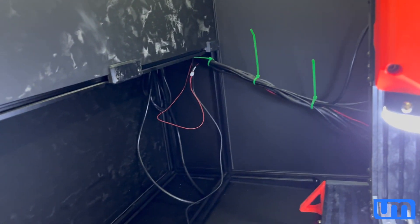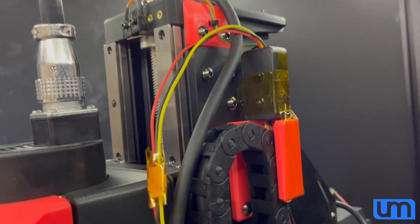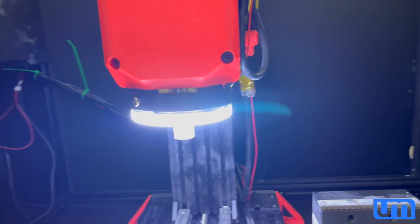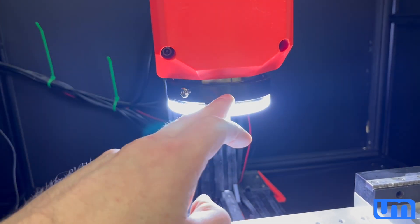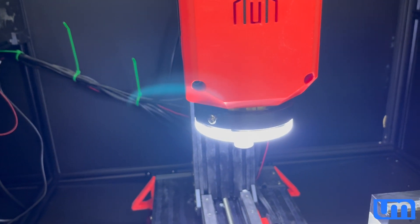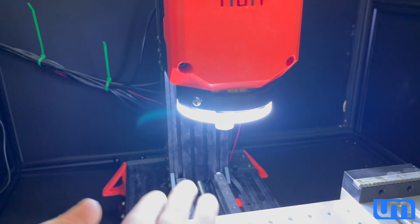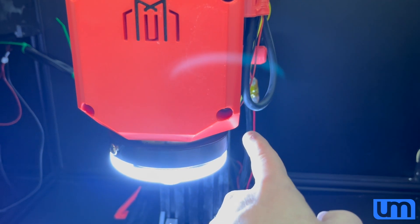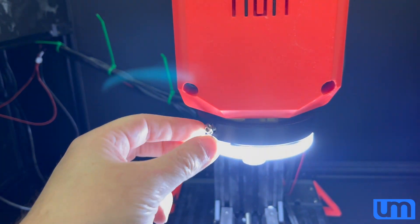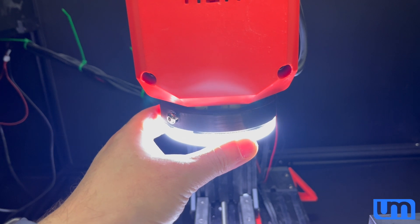All the cabling has been tidied up a little bit, except for just in there — I need to just cable tie that. Along here the LED stuff is all being secured and cable tied. It looks like it's just capped on there but it's actually secured. The actual ring is now printed out of nylon — PA-12. I didn't do carbon fibre nylon because I don't want to put carbon fibre through my printer. It fits quite snug. I had to soft hammer it into place. But then I've also got these M5 bolts, one over there and one at the back, and these actually go into insert nuts from the inside, so when I tighten this up I can't pull the nut out. That's tightened into the spindle so that is not coming off — maybe not ever. And then this has been both super glued and double-sided foam tape into place. That's not coming off either.